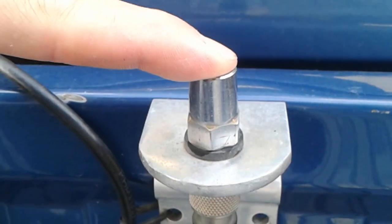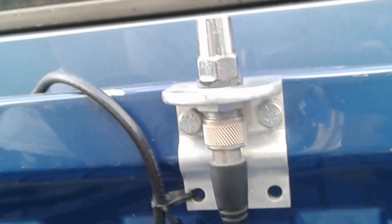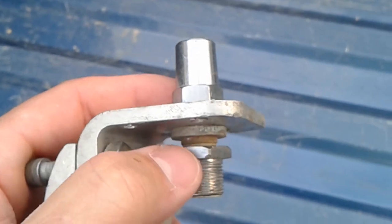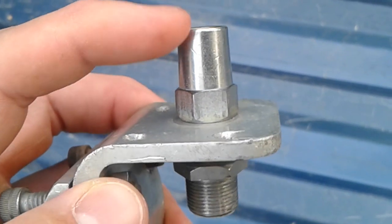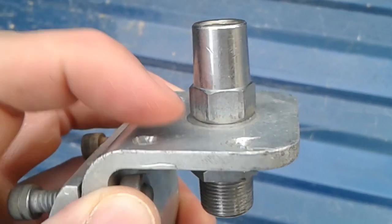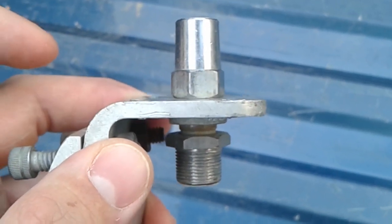The center conductor is insulated by this plastic washer and goes to your antenna — the antenna only. What some people are doing is putting this plastic washer on the bottom and then attaching this metal part directly to the bracket. That's a direct short. Your SWRs will be through the roof and your antenna will not work.